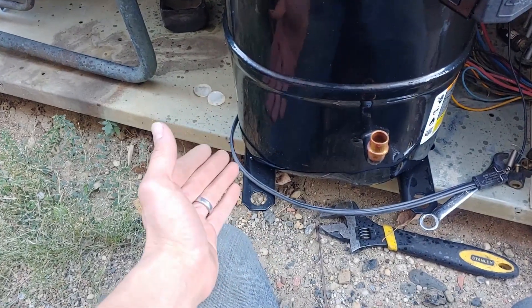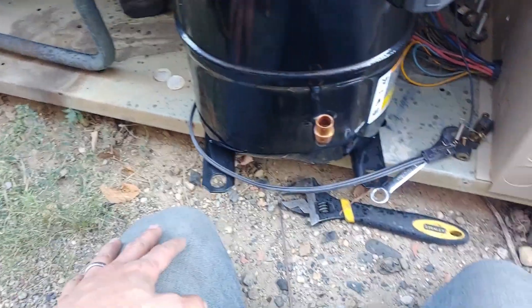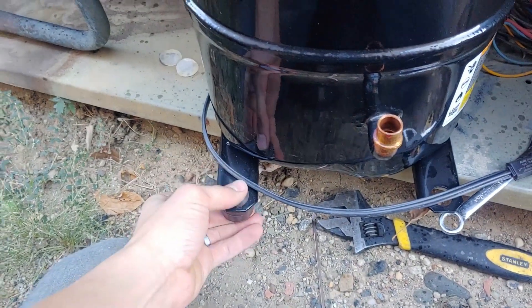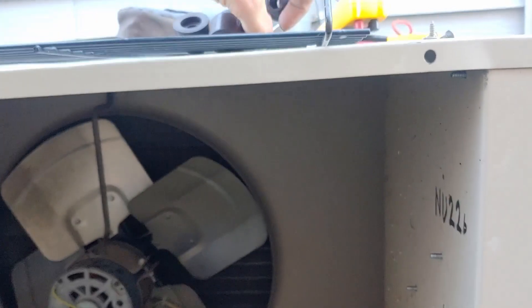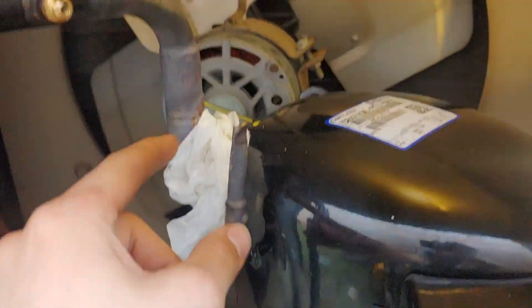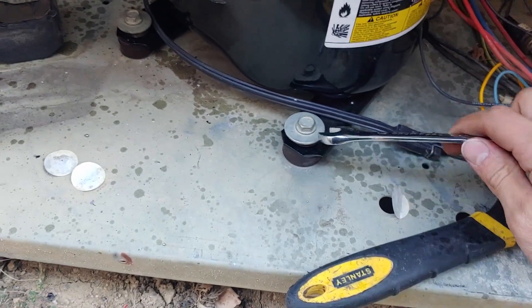Got the new crankcase heater wires pulled in and wire-nutted to a couple of wires that come right up here and feed off the top of the contactor. That ensures that the oil in this compressor is always warm, therefore eliminating cold starting problems and increasing the life of the compressor. We're going to stick on these little rubbers — they just pop on like that — and they have a bushing to prevent you from over-cinching the rubber gasket. These absorb vibration while the unit's running. Then we'll get it bolted down and brazed back in.